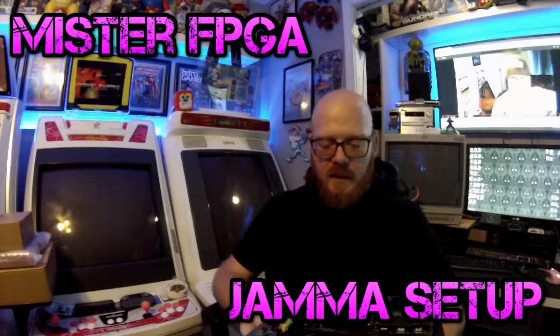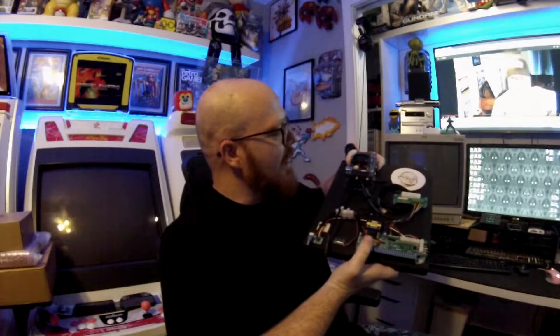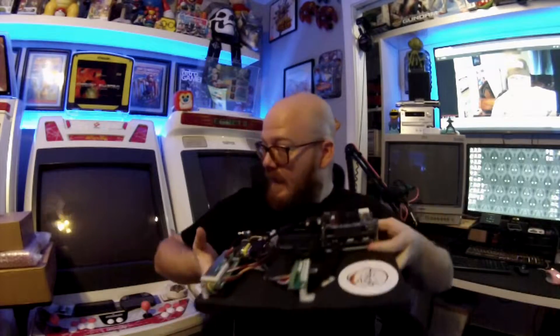Hey, what's going on everybody? Back for another episode. This time we are going to be checking out some stuff I've done to my MiSTer FPGA setup. The MiSTer FPGA, as I'm pretty sure all you guys know, is basically an emulator system that emulates hardware and allows you to play games on a platform that supports 15K for arcade monitors and PVMs as well as HDMI at the same time. I'll link you below to the GitHub. What I want to talk about is what I've done — a JAMMA platform I've built, which utilizes a JPAC and some other hardware to allow us to play the MiSTer on our candy cabs. We'll walk through the hardware and then plug it into one of the candy cabs and show you how everything works.